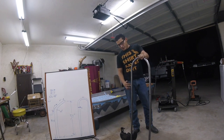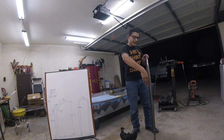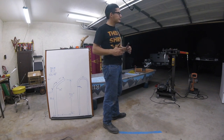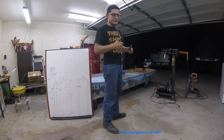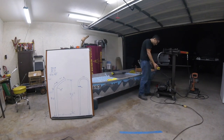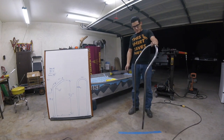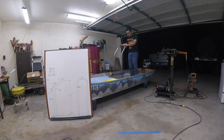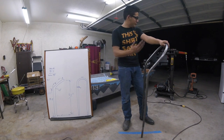Now would be gauging where I want to do a 45 degree bend. We're going to have to do two bends and this is where it gets tricky because both bends have to be on the same axis. I measured it out from the top point down to 10 inches — that's where the bend is going to start, and that bend at 45 degrees is going to consume five inches. It looks like I got it at exactly 90 degrees, so that should be parallel on this bend. Putting these two down — that's parallel. Ideally this height, I want it to be 34 inches. I surprised myself for being so rusty.